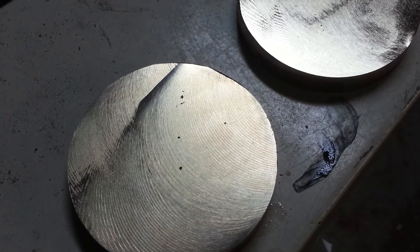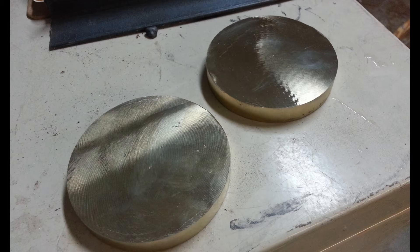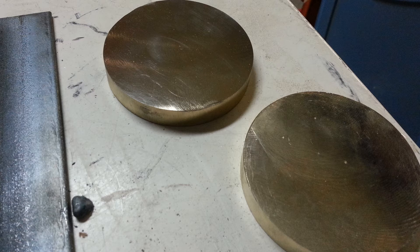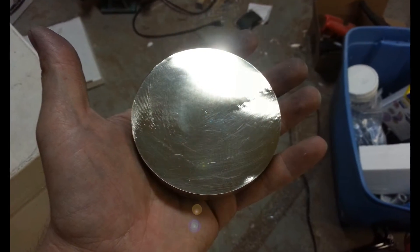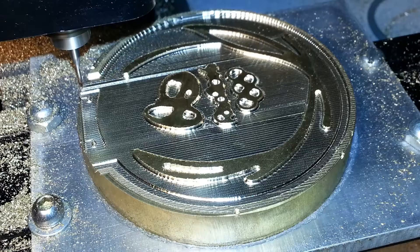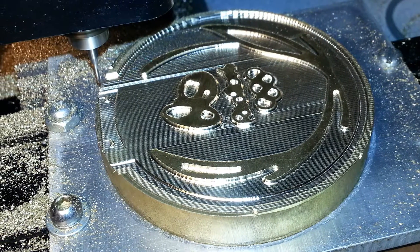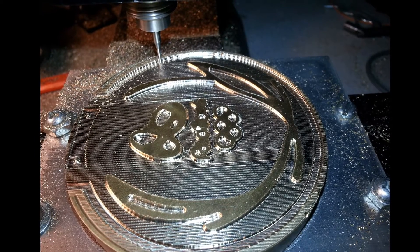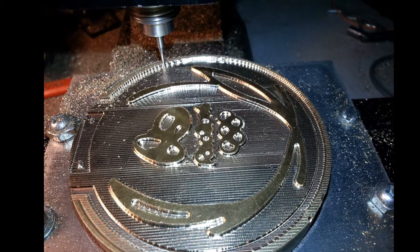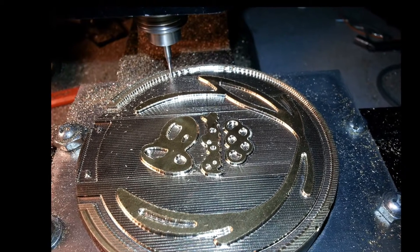After they were faced on the mill, they ended up looking pretty good — just a few bubbles here and there. I gave the milled surface a quick shine with 600 grit paper to make sure it would polish the way I wanted. The selected blank was stuck to an aluminum plate with CA glue. Mounting holes were cut in the plate, and it was attached to the Sherline CNC mill, which had just enough Y-axis travel to accommodate the part.